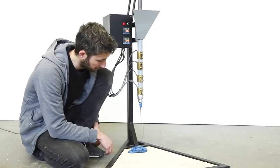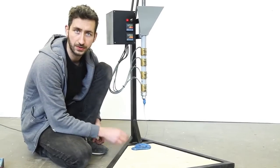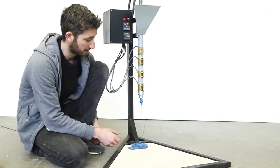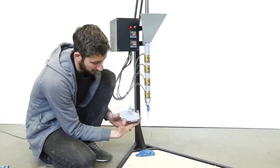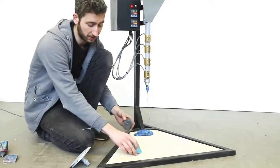The injection went pretty well — the color is good, nice texture, and it didn't smoke, so we have the right temperature settings. Usually we don't inject plastic freely like this but instead screw a mold underneath and squeeze the plastic inside, and in this way we can create all sorts of small objects.